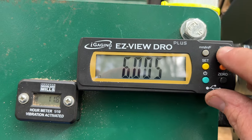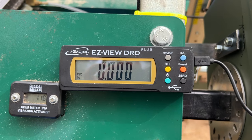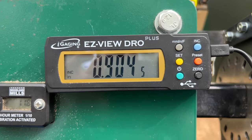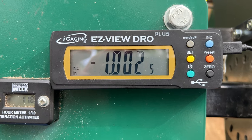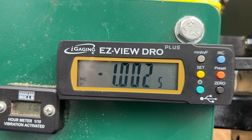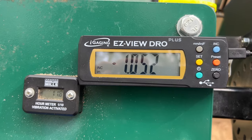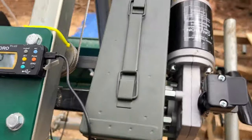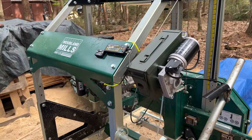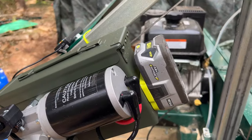Let's try it again - zero that out, go back to zero, let's just do another one inch so you can get a sense of it. There's 1.02 - bugs are awful today. I wouldn't want to cut right there, I want just a tiny bit more. 60 thousandths, sixteenth of an inch kerf allowance - I don't think that's terrible. So again, this is made out of an ammo can, tarp motor, run off of Ryobi tool batteries.